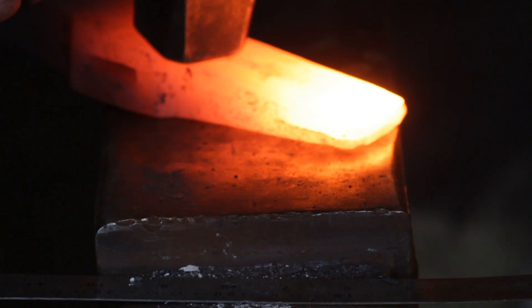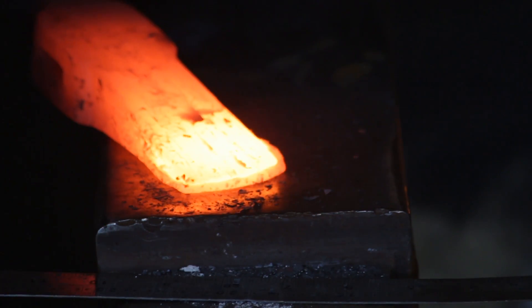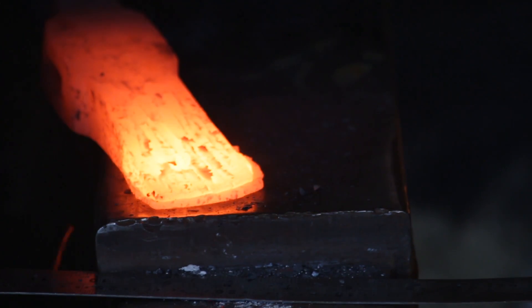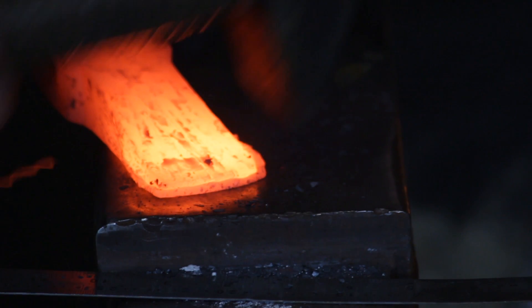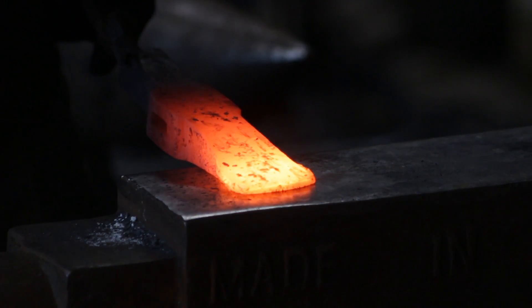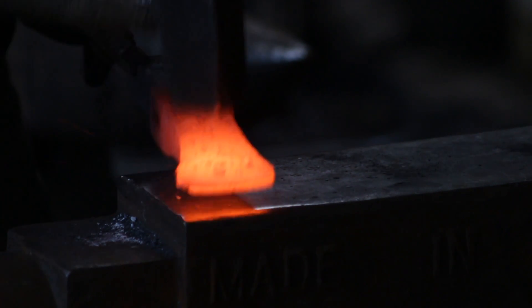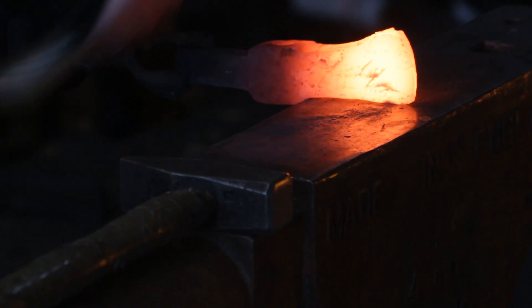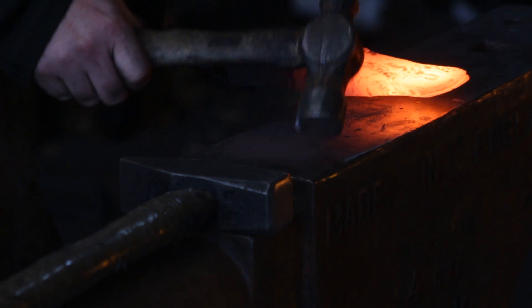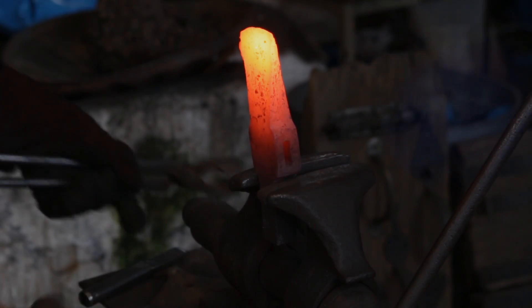In hindsight I wish I'd spread it out a little bit more before tapering, but it's not the end of the world because I was still able to leave it a little bit thick and then go in with the cross peen and spread that out a little bit — I'm looking for a final edge dimension of 60mm wide. I had to spend a little bit more time cross-peening than I would have liked, but there we go. Once it's been peened out to 60mm I will go in with the flat face of the hammer and just take out those cross-peen marks. I will then start putting a little bit of a curve in there because, if you look back at the drawing of the original, you will see that the blade itself curves backwards ever so slightly, and I will mimic that same effect.